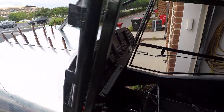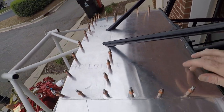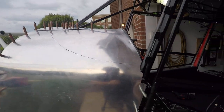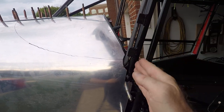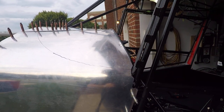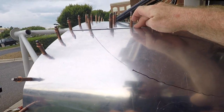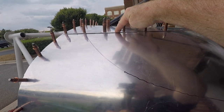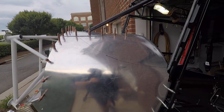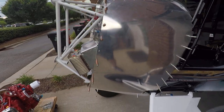We've installed the instrument panel in the boot cowl. This panel is removable and tilts forward — it's hinged at the bottom at a 30-degree angle to the post. The kit has the panel pretty much in line with that, so we've got a better view angle when sitting in the top seat. One thing I learned is that when you dimple holes in sheet metal and one-eighth inch holes get dimpled, the clecos really don't hold as well, so this will get sucked down once I get my nut plates in there.